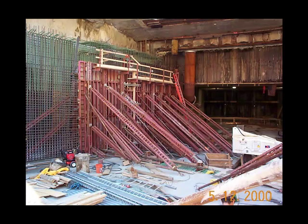What we just saw is the typical two-face form, but you will run into situations where you use a single-face form. This is a project where the structural wall was poured up against a slurry wall, so there is access from only one side. The form in this case must be extremely stiff and extremely well braced because there are no tie rods — the hydrostatic head of the wet concrete has to be carried by inclined braces, each of which must be anchored to the floor slab. You also have all the issues associated with the bulkhead form, and there is a form in place here being braced with these inclined braces as well.